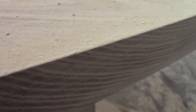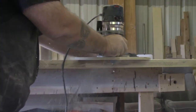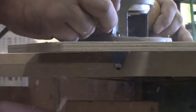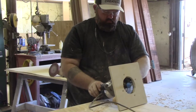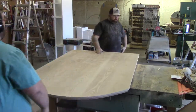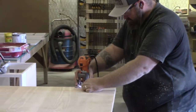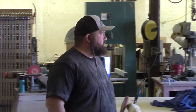I'm going to use a chamfer bit and chamfer the bottom edge. It's actually a 60 degree chamfer — it feels really good, it's not nearly as drastic as a 45 degree and it looks really cool too. I'm hogging away the majority of the material on the first pass, then doing a cleanup pass. Then I flip it back over and put an eighth-inch roundover around the whole top so it feels nice and smooth — important for a conference table where you rest your arms.